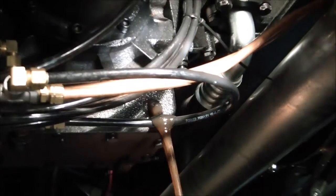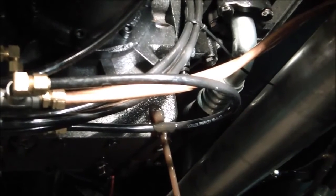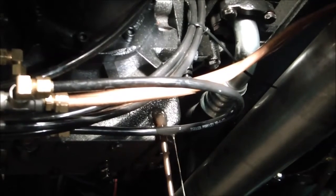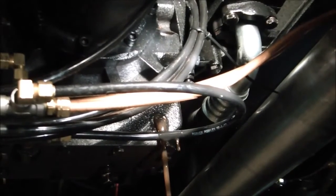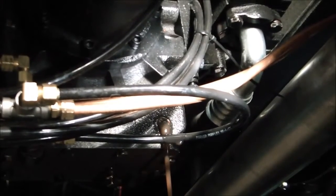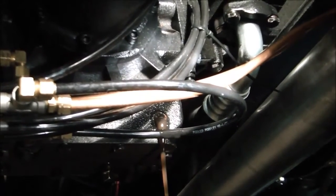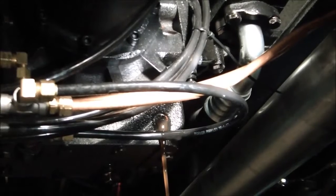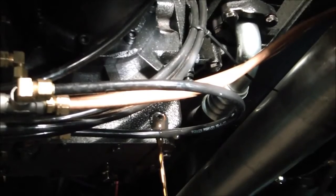Here comes our old oil — this is 80W90 gear lube. It should be changed approximately every 50 to 100 pumping hours. This is the same gear case that will be rotating whenever the chassis itself is just being driven around, so even if the fire pump is not being used often, this gear lube is still in the main drive train from the vehicle transmission to the rear wheels. I would recommend at least once a year this oil be changed and replaced with new 80W90 gear lube.